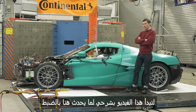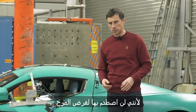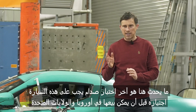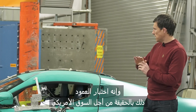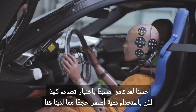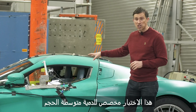Let's start this video by me explaining exactly what's going on here, because I'm not just crashing this car for lols. What's happening is the very last crash test this car has to complete before it can be sold in Europe and in the United States. And it's a pole test — it's actually for the US market, this one. So it's going to be accelerated on this sled into this pole at 32 kilometres an hour. Now they've already done a crash test like this, but with a smaller dummy than the one we've got in here. This one is for the average size dummy.